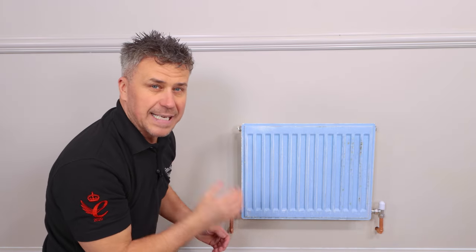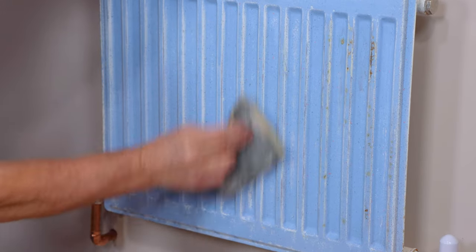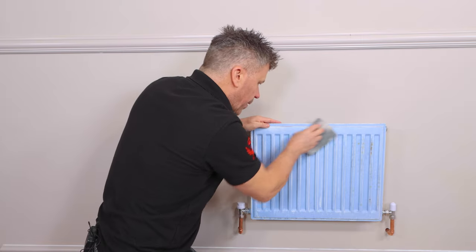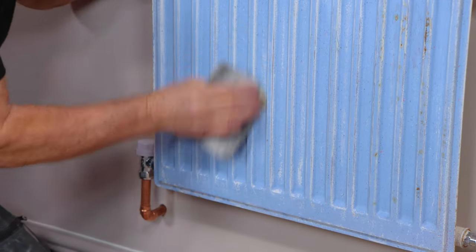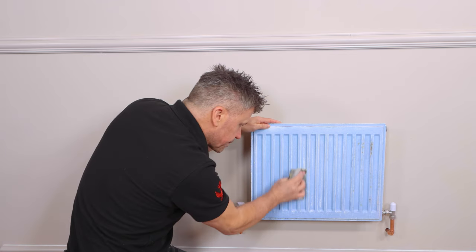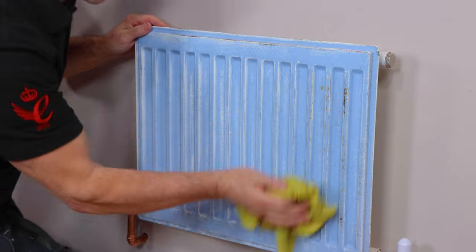But this is looking quite in good nick all over. I'm just going to give it a gentle little sand now with a light to medium sandpaper. Now it's also at this point if you do see any old drips that have dried out — could have been there a long time — you do need to sand them out, because if you apply your new paint on top, all that's going to do is enhance that drip.